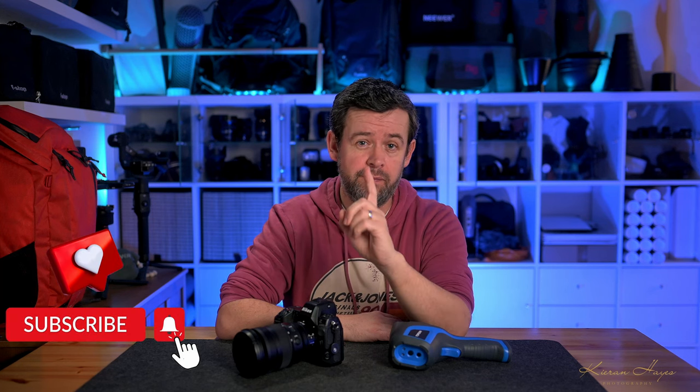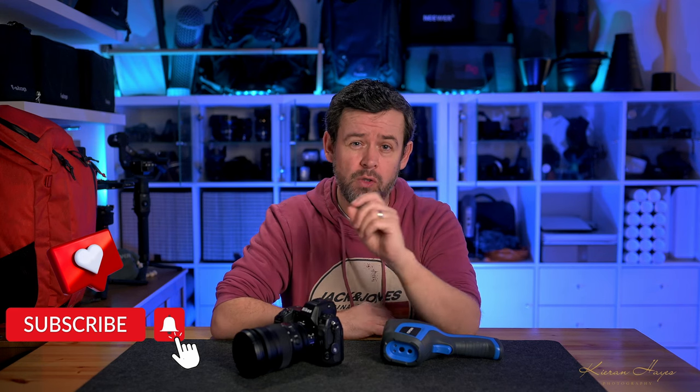I was concerned about something I wanted to try before the next recordings. I let the camera cool down for about 45 minutes, checked temperatures on the card slots, back LCD, and camera body — all seemed fine. I started another recording, and this is where I hit the problem I was expecting: the hot card warning came up after about 10 minutes and 43 seconds — about two and a half minutes shorter, even though the camera had been cooling for 45 minutes and all external temperatures looked normal. Heat is building up inside the camera body that simply can't be dissipated.